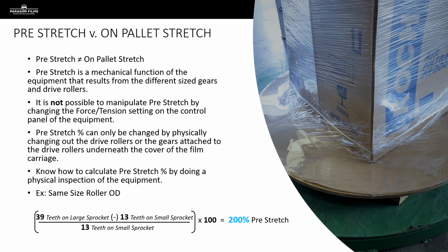So in this example, we've got 39 teeth on the large sprocket, 13 teeth on the small sprocket. We subtract those two, divide it by 13 teeth on the small sprocket, multiply by 100, and that gives us a 200% pre-stretch. This math changes a little bit when we've got different size roller diameters.